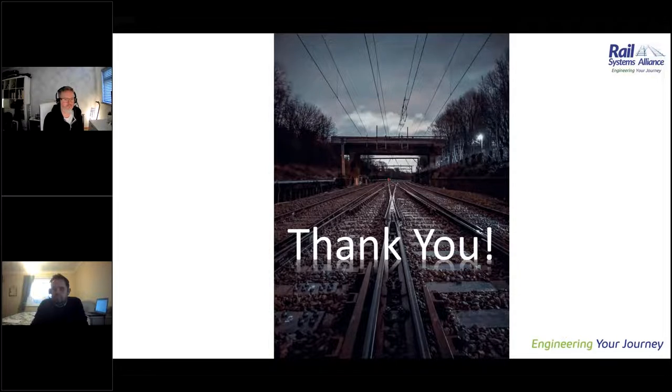Brilliant. And we did check the runs as well. We checked the runs of the catch pit between the rodding eyes, so that when we replaced the catch pit with a rodding eye, it wouldn't counteract the flow of the water. The grade of the drainage runs and falls weren't altered. It was just that the catch pit was directly replaced with a rodding eye.